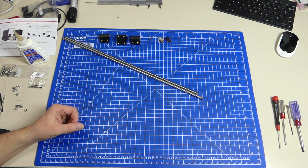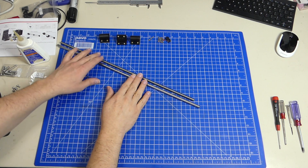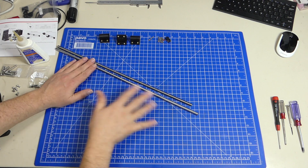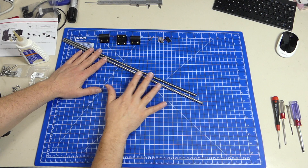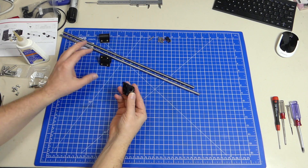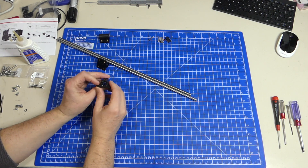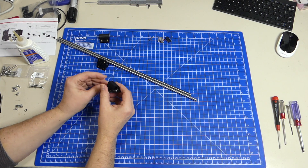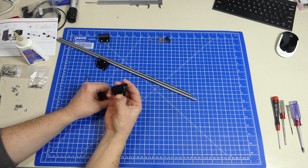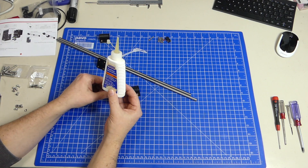Before we start building, I want to give some advice. First, make sure everything is in good order. Place your rods on the table and let them roll — if they wobble or do some sort of belly dance, pack up the printer and send it back, you can't fix that. Second, regarding linear bearings: a lot of people will tell you to go for igus bushings, but I prefer linear bearings. These bearings come without any grease in them and they really need it — you'll need bearing grease.